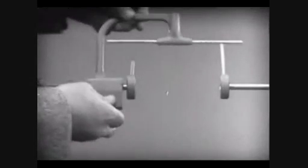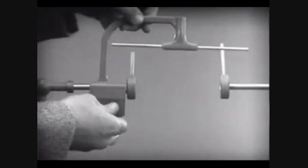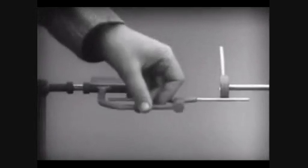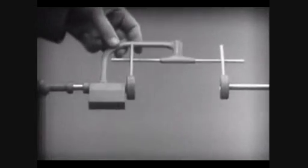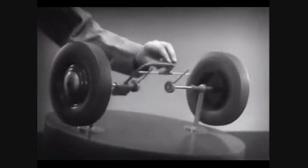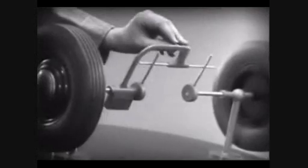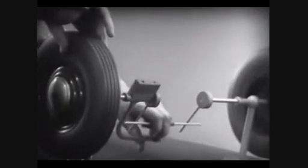Let's get something to hold this bar in place so that it will press against the spokes. Notice that this support is not locked to the axle — it turns freely. Now we can spin the wheels by rotating the support. This is fine as long as both wheels are able to turn at the same speed. But let's see what happens when we go around a corner. With this arrangement, we cannot drive one wheel faster than the other.